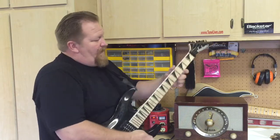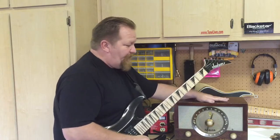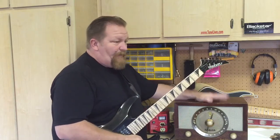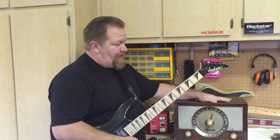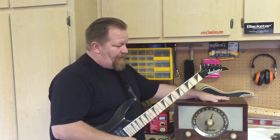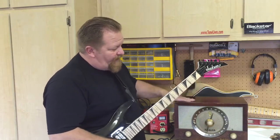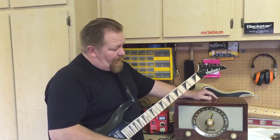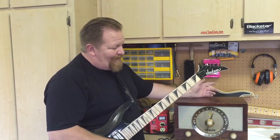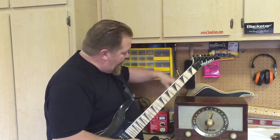So for all those guys out there who say I can't afford this and I can't afford that, that's why I did this video. We paid $42.50 for this, because I think we got two of them on a deal at one place and two at another place. It's got a slight little hum in it, and it probably could use a guy that works on tube amps, or I could trace it. It probably has a bad capacitor, and that's why it's humming.